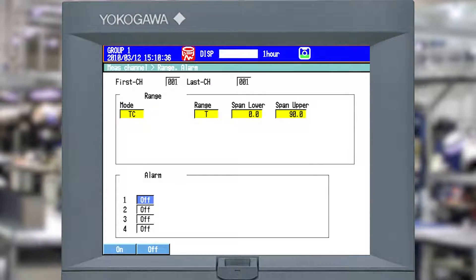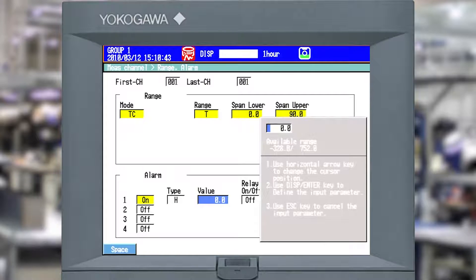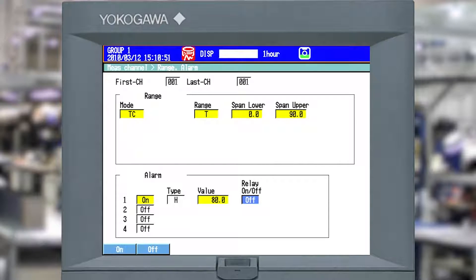Once I've got that, I can go down to alarms. I'm going to turn on the first alarm and set a high alarm - I'll input something like 80. If it gets above 80 in my office that's a little too hot. Under relays I can turn that on. If you see I01, 02, 03 and you purchased your unit with the alarm relay option, these correspond to terminals on the back of your unit so you can fire off relays when it goes into alarm. If I hit next a few times we'll see S1, S2, S3 - these are internal memory switches you can use for event actions later. I'm going to set mine to switch one and show you event actions later that you can tie to these internal memory bits. Essentially if this gets above 80 it fires off an internal memory bit.